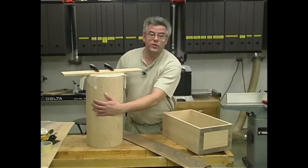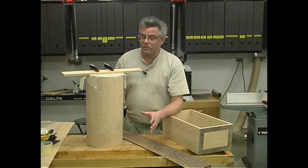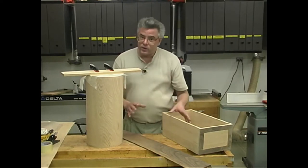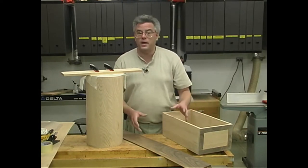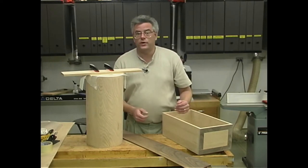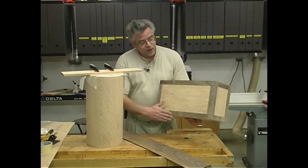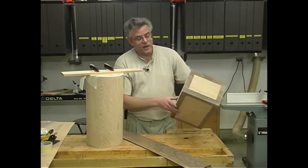After about two hours of hand planing, I then went through and finish-sanded all the oak pieces. I got my top nice and curved just the way I wanted it. At this point, you do have to finish-sand all the oak pieces before putting on the banding, because it's going to be very difficult to sand afterwards. I've already got started on the bottom portion of the treasure chest with the walnut banding — I've got it on one end and across the bottom.